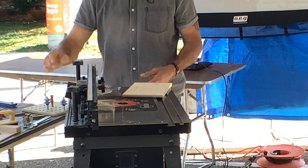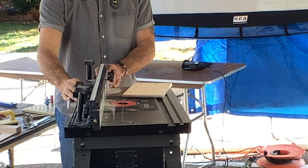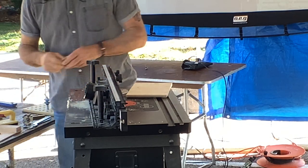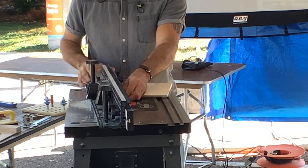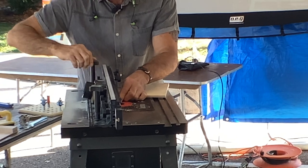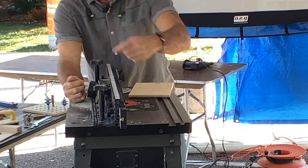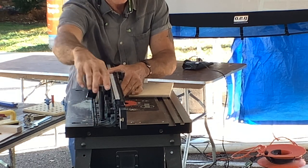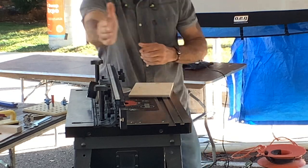And then depending on what you're trying to make happen here, we could lean on our bar stock again. If I want a half inch space between the bottom of the groove and the bottom of the box, my half inch bar stock can go in there. Use that. It's kind of kissing right now. And again, I've got one flute perfectly in this direction, at top dead center. Move the other end. I find it's a lot easier to adjust the fence by anchoring one end and making tiny movements over here, and then anchoring the other end, instead of trying to move the whole fence.